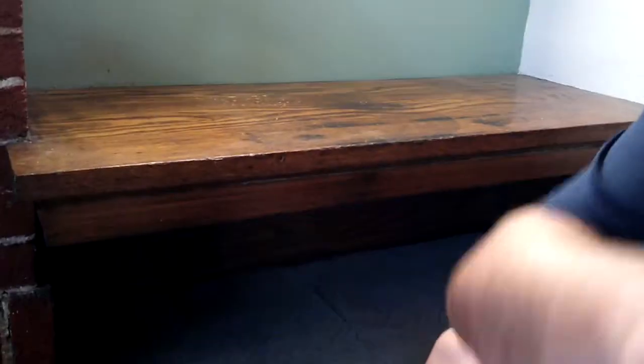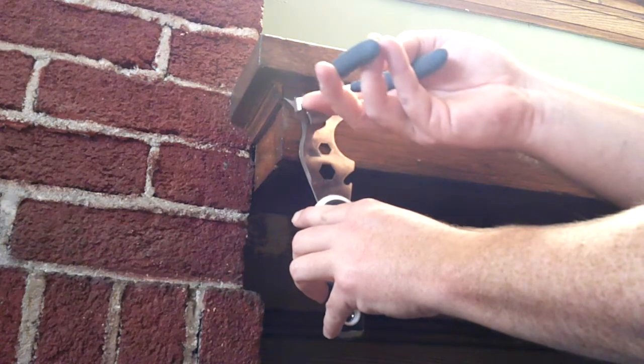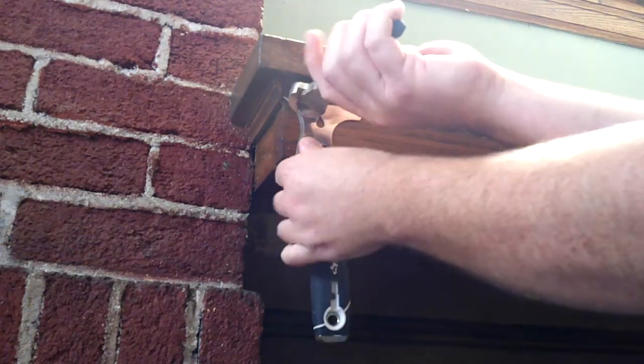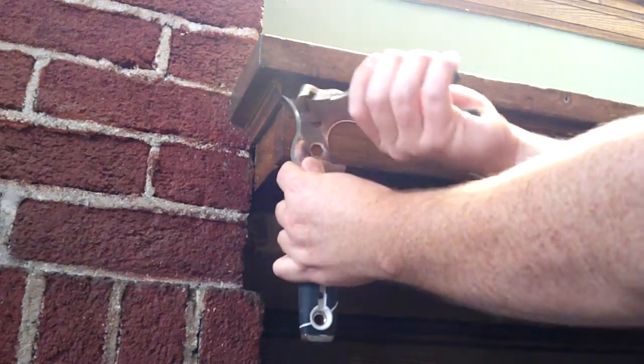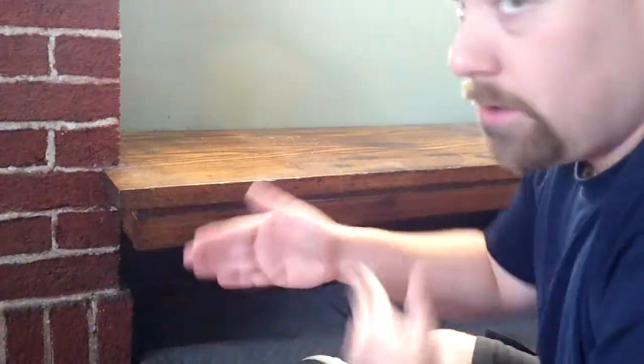Now I have to take these little itty-bitty nails out. The nails are still inside the wood, so I want to take those out without damaging it. I'll use my 501 tool right up on it like that, then pry against it gripping the duck bill and rolling the head — the nail comes right out. This keeps you from using a hammer, which can sometimes damage the wood.